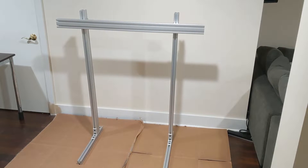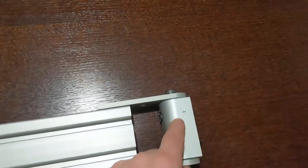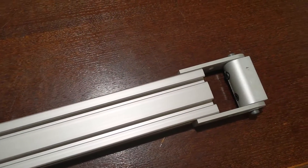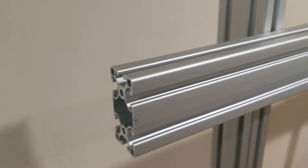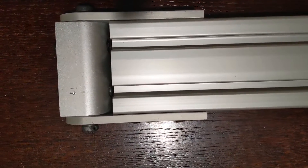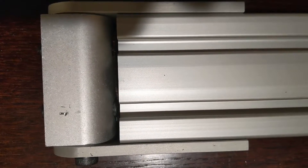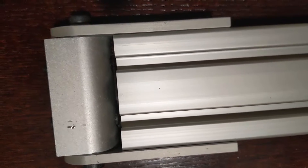All fixed — now we just need to attach the side sections. These pivots can turn freely in any direction. I'll be attaching them to the side of the 24-inch 15x30 section. It's important when you attach it and slide the T-nuts into the slot that you leave a little space between the nub of the pivot and the end of the extrusion, so it has room to move.